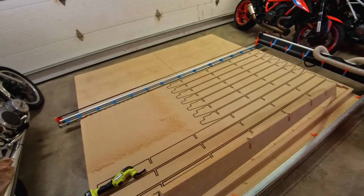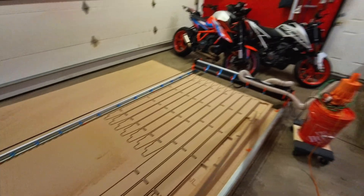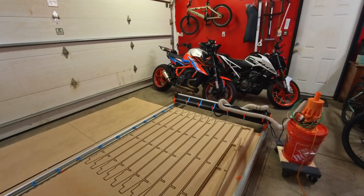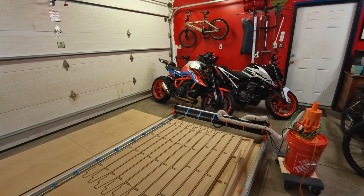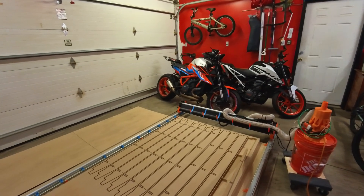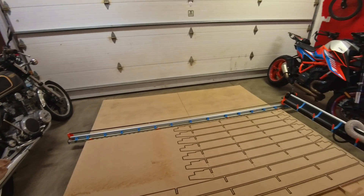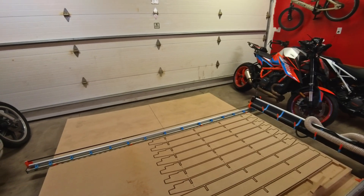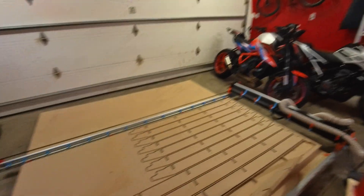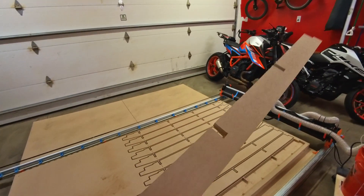It's a little rough — I don't think I had enough over-cut. The issue is that because I had to rig this table up on my garage floor, it's not very flat. The garage floor is actually very unflat, so I had to set up two-by-threes underneath to try to compensate for some of those dips. That's what's going on with the cut quality.